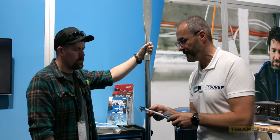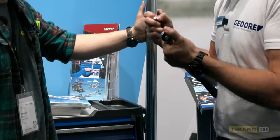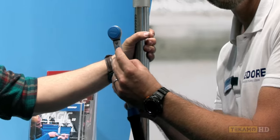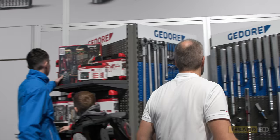For the smaller torque wrench, I think that's also interesting for you. When you have torque wrenches with this mushroom head, we have the same system. That's good to know, because mostly in the market, torque wrenches with a ratchet you can change are fixed — and when you change it, it's only calibrated for right tightening. But here, when you have this mushroom head, you can do the same as here. So from here to here we have one lever, from here to here the other one.